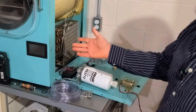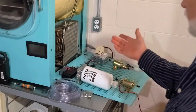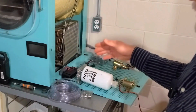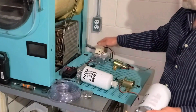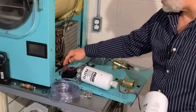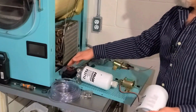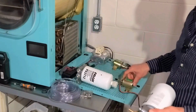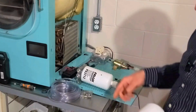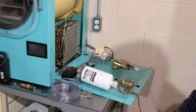So what happens if I get a lot of water in the oil and I want to run this longer, I can flip the switch, turn on the vacuum pump, which also powers my 12-volt power supply here in my meter. So then it'll cycle my fuel pumps to filter the oil some more. So that helps get the moisture out ready for the next load.